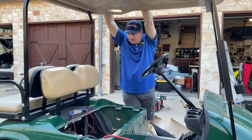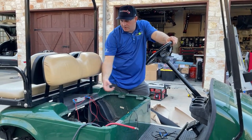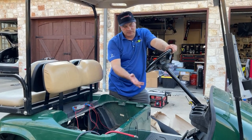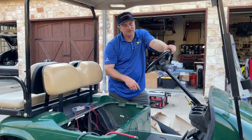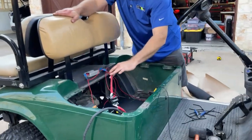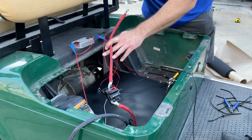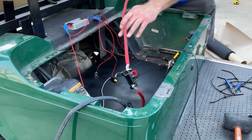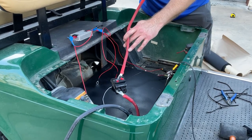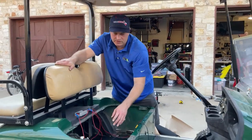Because we have a lot of 12-volt stuff — we're going to put a light bar in the front and everything — I have a buck converter here, which is just a step-down transformer. It brings this from 40 volts down to 12, so we can use toggle switches, sound, light bars, or whatever we want. I also put a main disconnect breaker here so we can cut the battery easily anytime, and it's just a safety thing — especially when working with lithium-ion batteries, you don't want anything to catch fire. If the battery starts getting hot, it'll cut the circuit so it cools down.